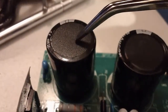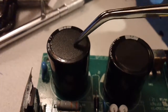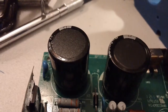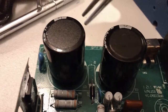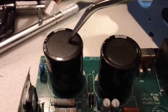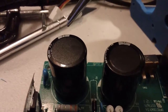Here are the two giant mains-voltage caps — these are 650 microfarad, 250-volt capacitors. This is a power supply intended to work with European or North American voltages of 110, 120, 220, or 240 volts. These are big reservoir caps used to store lots of energy and provide a smooth, stable voltage and power for the rest of the unit.